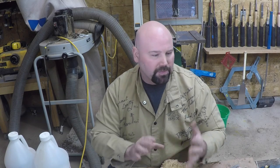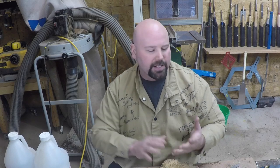So we're going to take you through all the steps that I've come up with. And like I said, these are my steps. They're not the only way to do this, but there are a couple things that I will tell you that they are the only way to do things, and that has to do with moisture and pressure. You have to use a pressure pot, and you have to have no moisture in your system, your process, your wood, whatever you're casting over. Those are the two most important things that people seem to get wrong. So we're going to take you through a step-by-step of how to correct those two things.